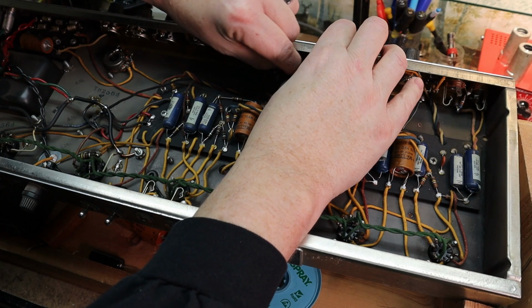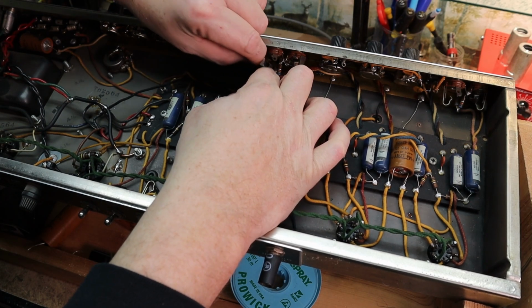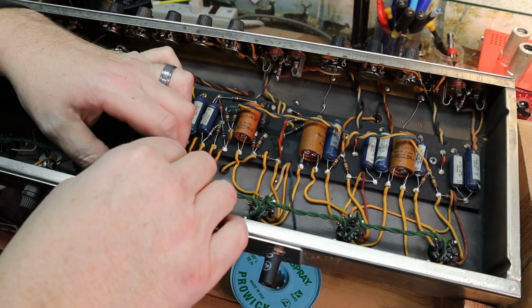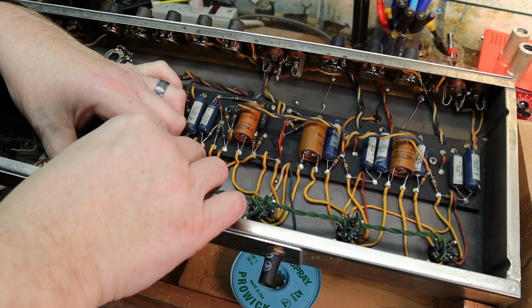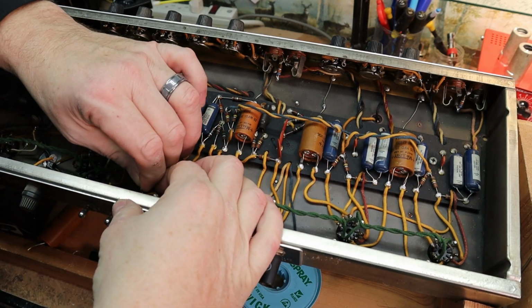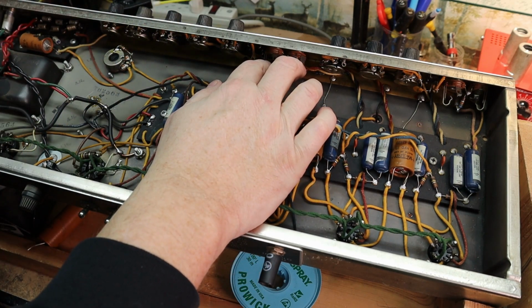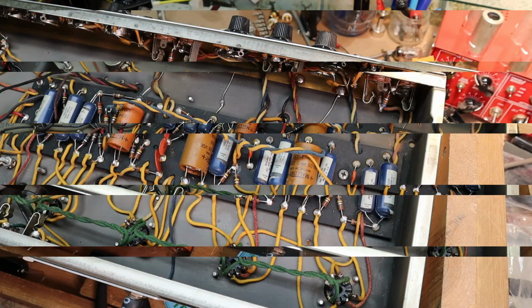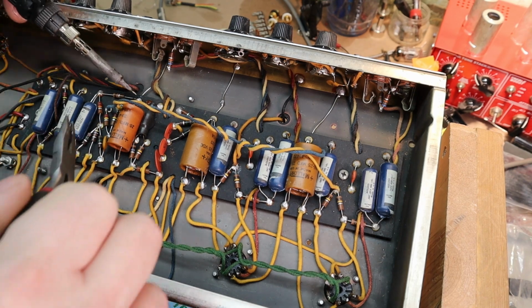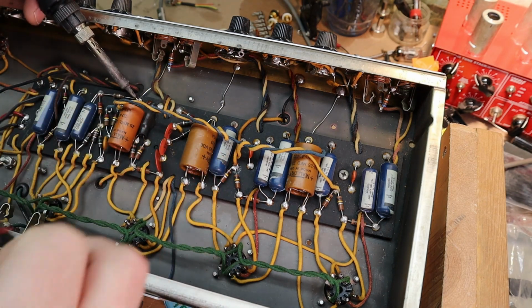They're awesome switching jacks. The new production ones, not so much. When I first started building amps, I was like, Switchcraft's a good brand, so I went and bought a bunch of them, built some amps, and ended up replacing every single one. Now I use Cliff jacks, because I haven't had problems with those, but every single new production Switchcraft switching jack I put in an amp, I ended up replacing them all. So I think what we'll do is pull them out, clean up the holes with a manual solder sucker or a little bit of solder wick.